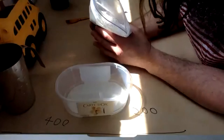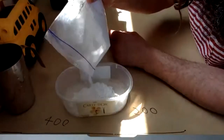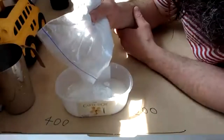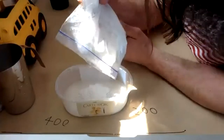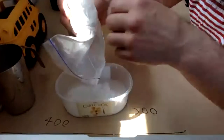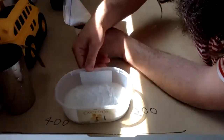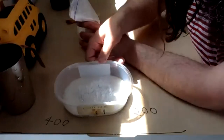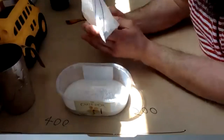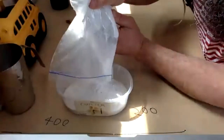You don't need to throw it all in at once — if you chuck it in all at once it would just be a very difficult lump. Try to just empty it out gradually. What you want to look for is a kind of island forming in your water — a bit like a volcanic island coming out from the water. Just sprinkle your plaster and it needs to just stick out of the surface of the water. You'll see the plaster starting to soak up the water really easily without even having to touch it.